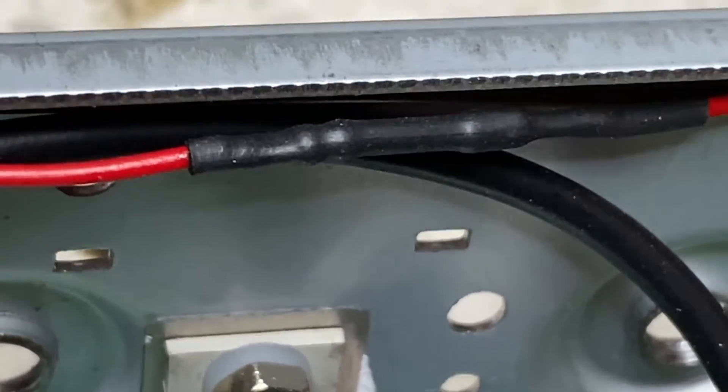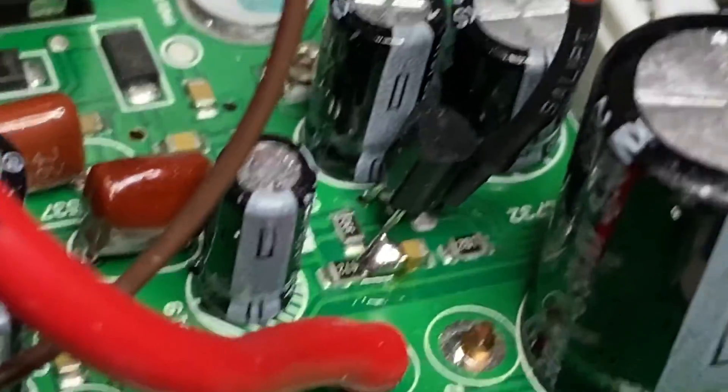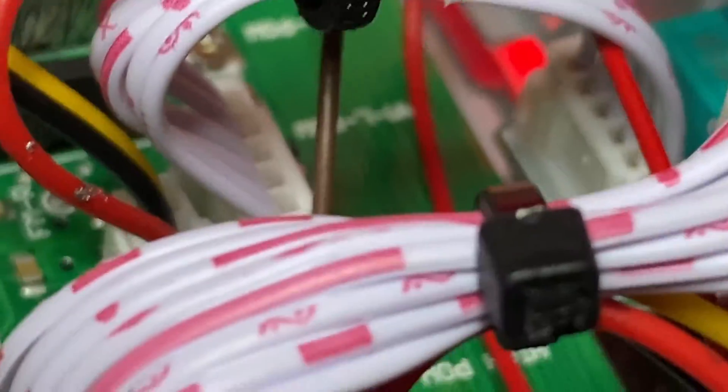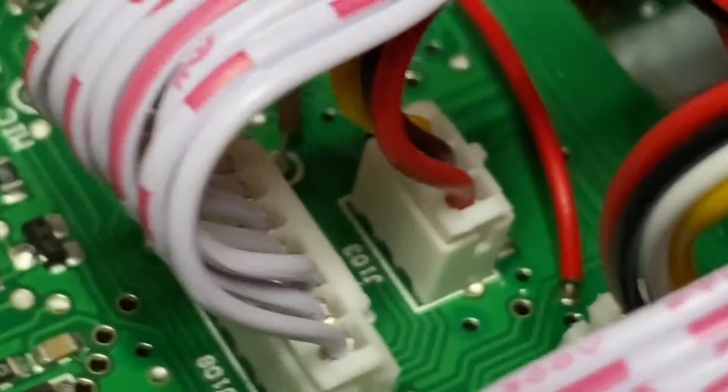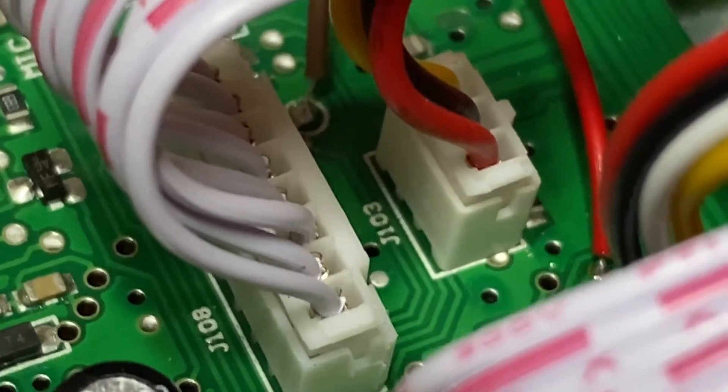The red cable goes into a 10k ohm resistor and a 1N4148 diode with the cathode towards the transistor side. The other side of the red wire goes to AM 8 volts, tapped right there next to connector J103.